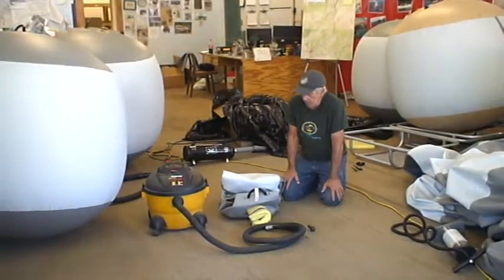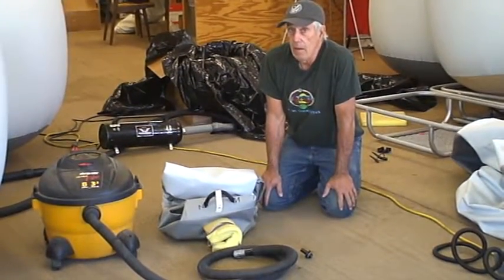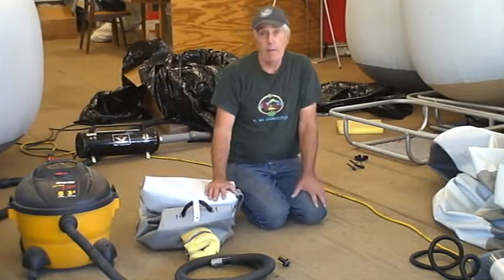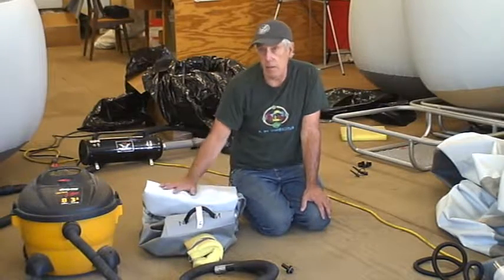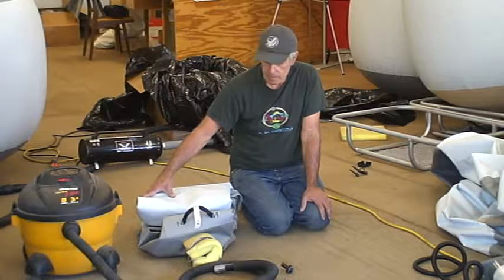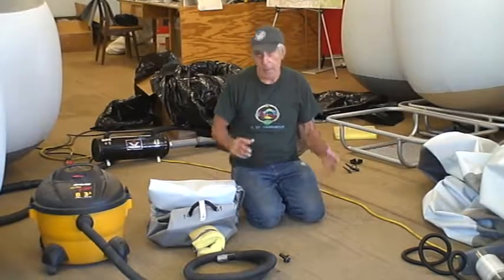So, remember the important ideas here are that when you fold something up like this in very, very cold weather, like minus 20, okay, the important points to remember are when you unfold this in very cold weather, it might have a tendency to crack. And so it's a very good idea to take this unit out, put it in the cab of the truck before you get to the next site so that it's nice and warm when you unfold it to put it inside of the culvert. Okay, you want to unfold it as much as possible while it's warm and then inflate it as fast as you possibly can. And then get it into the culvert.